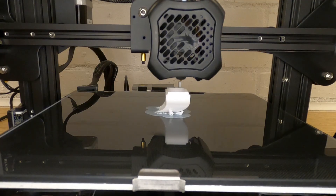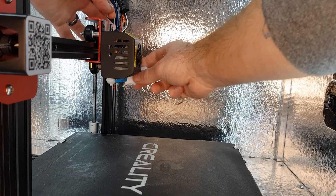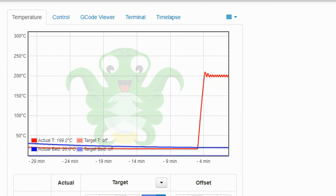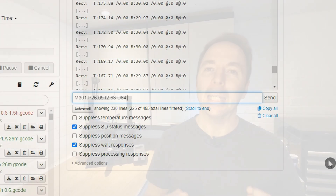With the parts printed I assembled everything and checked that everything sat in the right place. I printed everything in PLA Plus as it has a slightly higher melting point than PLA and is just as quick and easy to print with. Before we can print anything using our new parts we need to calibrate the hotend by doing a PID tune. I'll do a separate video on how to do this in the future, but basically it controls how quickly your hotend heats up and makes sure that the temperature doesn't overshoot.